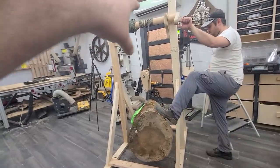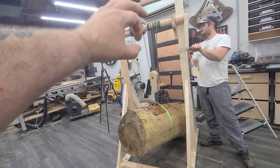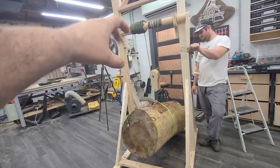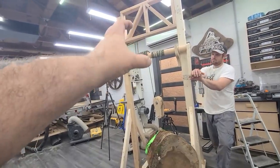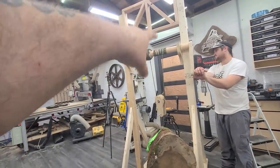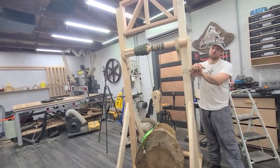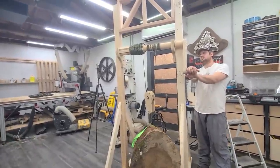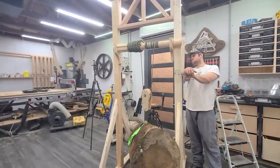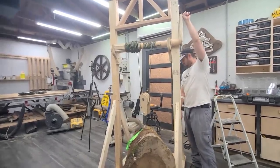So with the variations of the different size rods, and if we make the center rod out of steel, make it a lot smaller, and then make only the step up like half inch instead of right now, it's an inch and a half because we have 3/4 inch on both sides. So if we made it, let's say 3/4 inch step up and just put extra rope on there, you should be able to lift maybe a ton without too much trouble at all. I think we need to do some more experimenting.